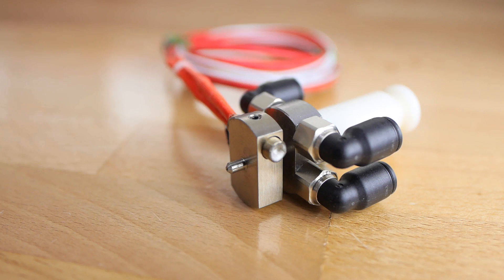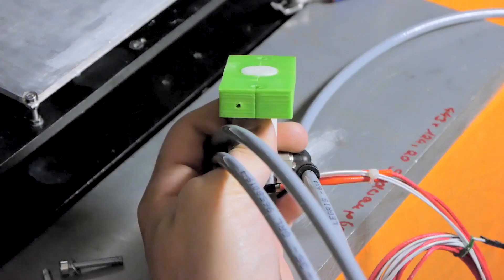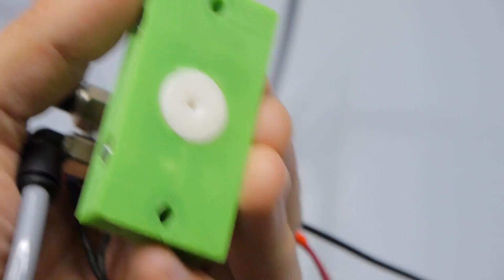So let's try to get this thing going. The OPAM is 66mm long overall, so it's shorter than an E3D V5, but still longer than an E3D V6. But you could easily replace the stock 16mm groove mount style mount with a shorter one or with any other design. The included one fits well enough into my standard universal clamp-type mount, but I did notice that the printed part did not have a chamfer to make inserting the filament easier, so I added one — excuse me using a drill for this, I didn't have a small enough countersink at hand.